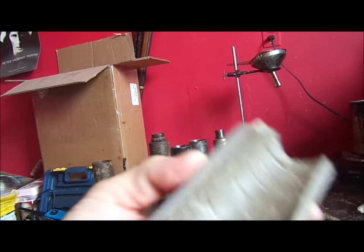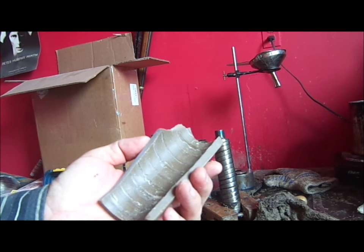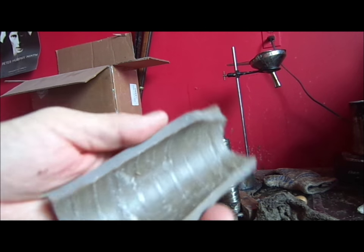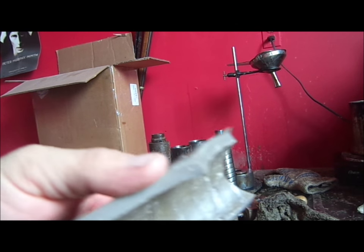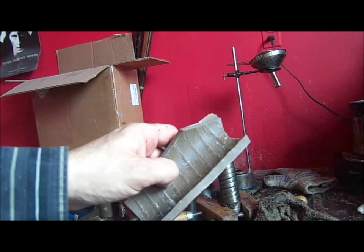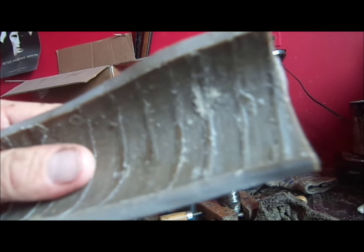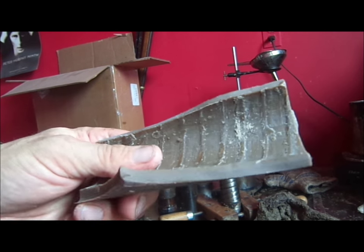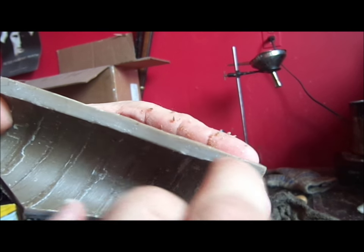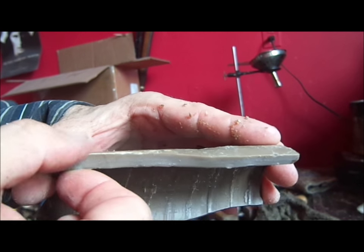One of the interesting elements is people wonder, is the wax solid throughout the record? Well, this is a broken portion of a blank. And so you can see the spiral core of the blank. So we're going to do some tests here to show you some things. If you look on the side, you'll notice that the wax is indeed solid throughout. There's no white little element of crystallization. If you have a bad blank, you'll see a white line here, very prominent, a bright white. And you notice that it's perfectly amorphous all the way through this wax.